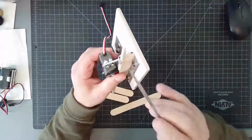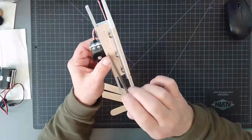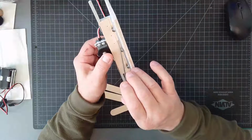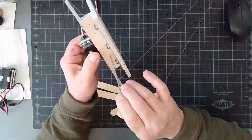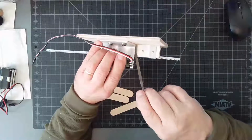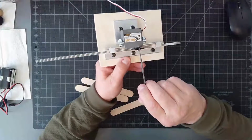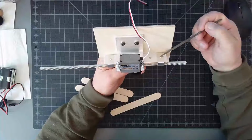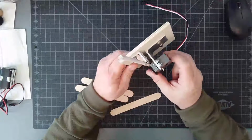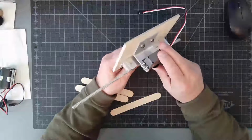As you can see, in this view, you can see right here how the rack is in this. You can see where the, I'm going to call them popsicle sticks from now on, popsicle stick is glued to the other 3 that were glued together. And then I mounted that on a piece of the 1-inch angle aluminum with the screws that come in the horn bag, the black gears that came with your motors. I used those screws because they were perfect little self-tapping screws into the wood to mount that to that angle aluminum.